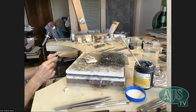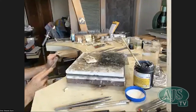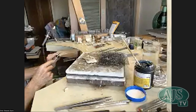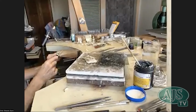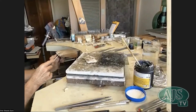That's great. So that tab is well underway. This has been done with quite a large barrette, but you could use your trusty little escapement file. And again, just filing down the height of the saw cut. Square that off. A barrette file is fantastic for this because it's effectively got a safety edge to it.